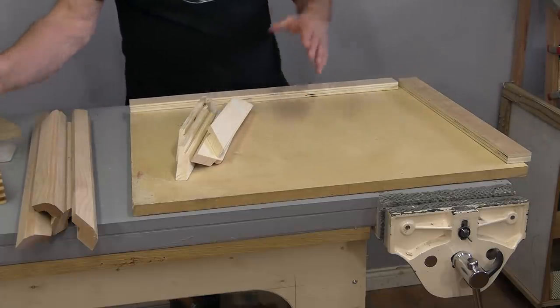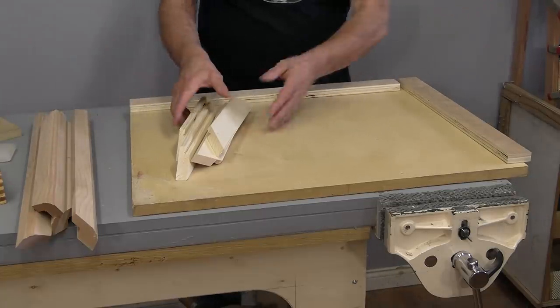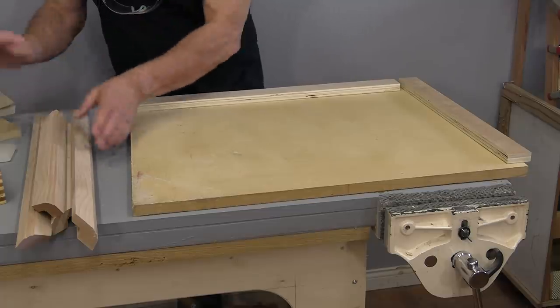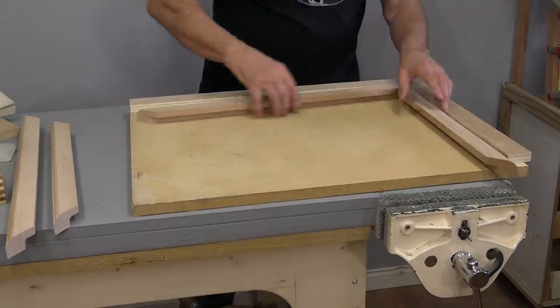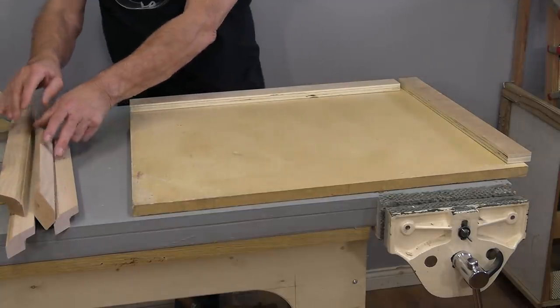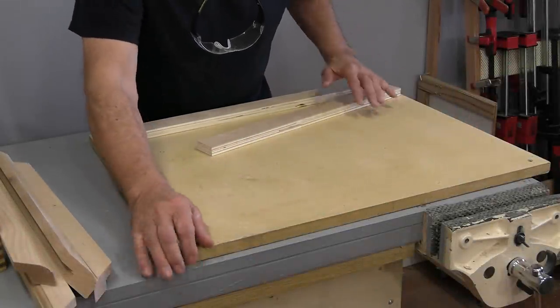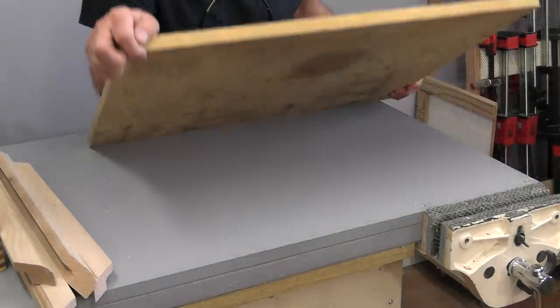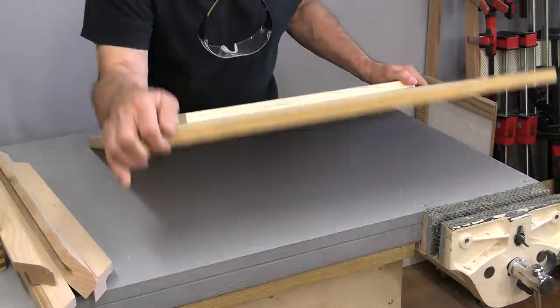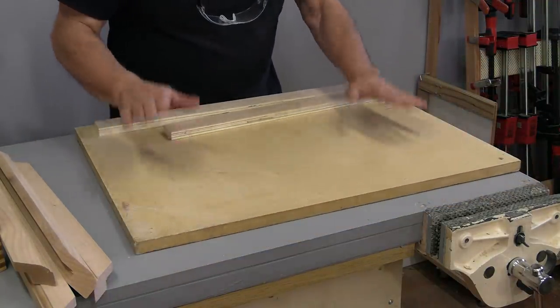I've made these in the past and every time I make one there's an update or upgrade, and I also make them bigger because I end up making bigger and bigger picture frames and I need something to align them. So today it's time to make a bigger one. The version today uses MDF. I really like MDF for an assembly jig because it's really nice and flat. This one happens to be used — you can see the back part has had lots of wear and tear — but this side is good and I've even sanded it down. It's nice and smooth.